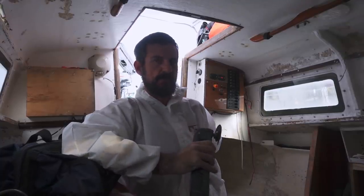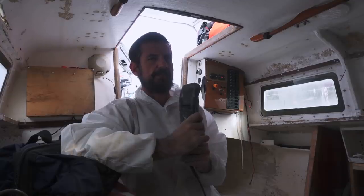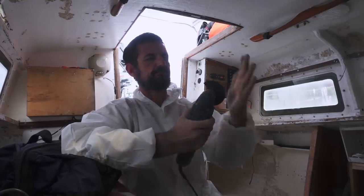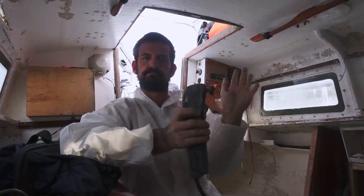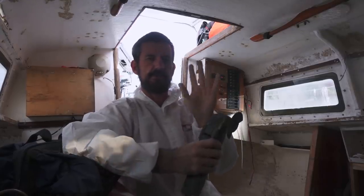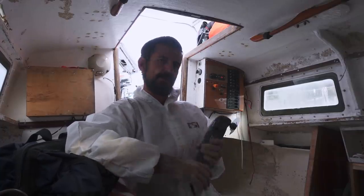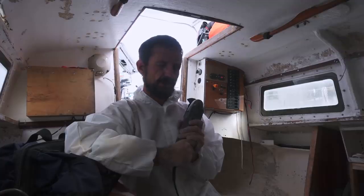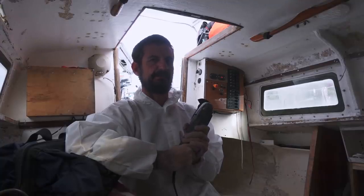For working in confined spaces it's not the quickest option, but I do like these multi-tools with a tooth blade. I'm going to be quite cramped in there without a lot of room to move. The nice thing about these — see that? No injury, no blood, nothing missing. Your skin moves beyond the range of what one of these multi-tools will do. Even though there would probably be more efficient tools, I can get in there with it and it's not going to throw loads of dust into the air. More importantly, there'll be no kickback and no risk of me suffering any sort of injury.